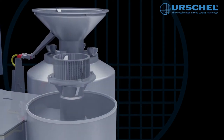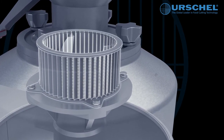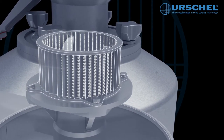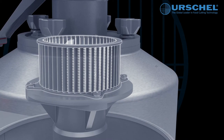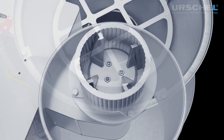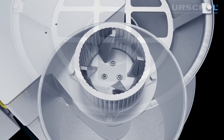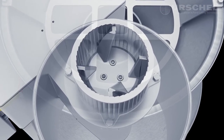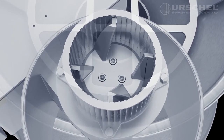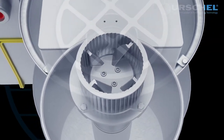Let's take a closer look at the operating principle with the 6 inch (153 millimeter) diameter cutting head. The cutting head is comprised of uniformly spaced vertical knife columns arranged in a circular fashion and held in place by thin horizontal separators. The leading edge of each vertical knife is a sharp knife edge constructed of special wear and abrasion resistant alloys. The distance between the horizontal separators and the vertical knife columns defines the opening through which the product must pass and helps determine the final particle size and shape.